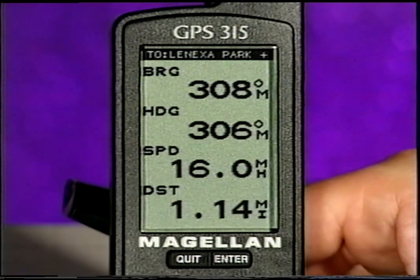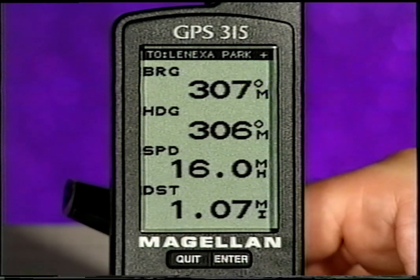The Nav2 display features 4 large, user-selectable fields that provide digital navigation data for your trip, and is an ideal display to use in fixed mount applications where you may be viewing information from a greater distance. The default data fields show the bearing and distance to the destination, along with your current speed and direction of travel. The units of measure used for each data type are indicated to the right of the displayed value.